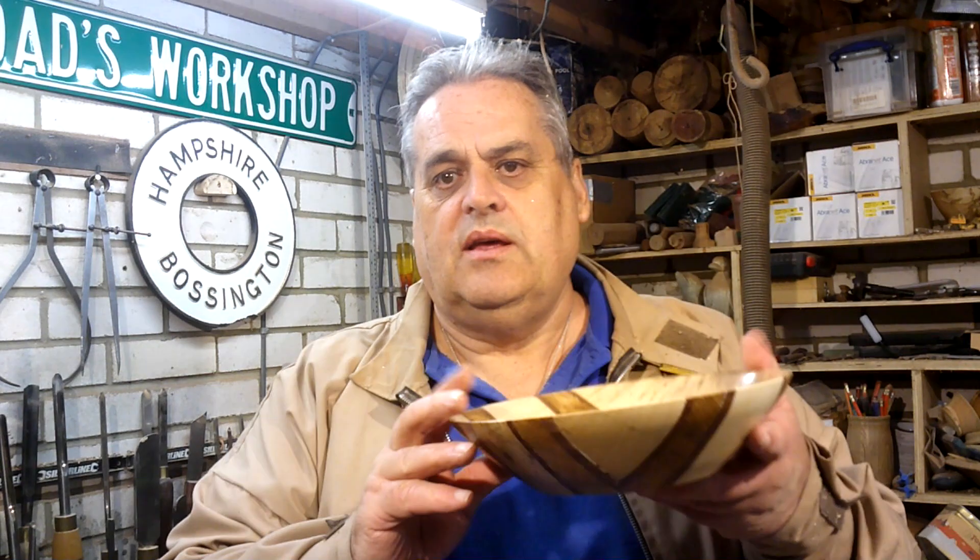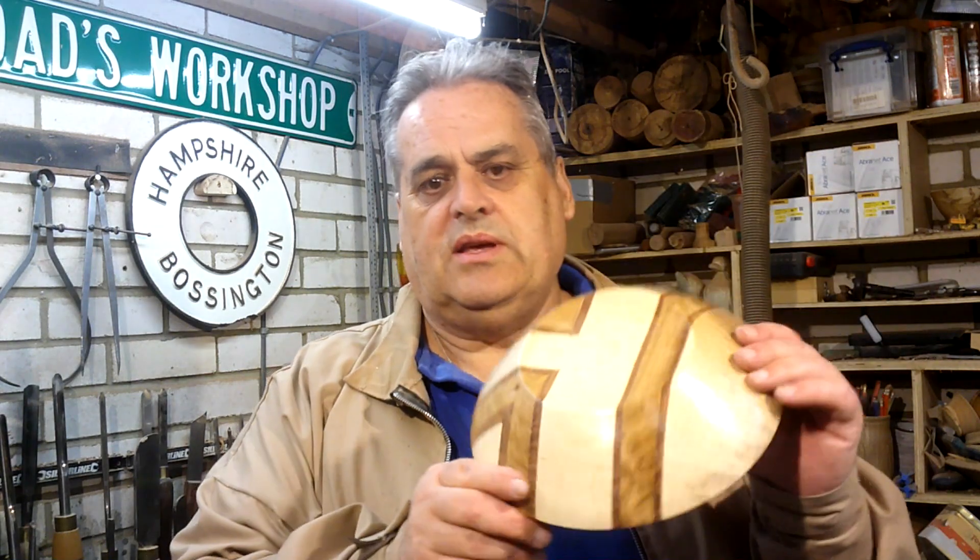That one's very difficult to turn because of the different hardness of the woods. The sycamore is quite soft, the oak is very hard, and as it comes around your chisel is constantly hitting different resistance - it's very difficult to get it right. But as I say, I'm quite pleased with that. Something a little bit different. I hope you enjoyed it - I enjoyed making it. If you did enjoy it and want to see videos like it, please hit that subscribe button, hit the bell button, make an old man happy. I will see you all again next week. You take care of yourself. Bye bye.